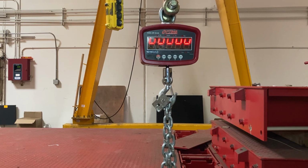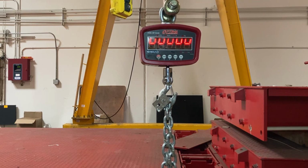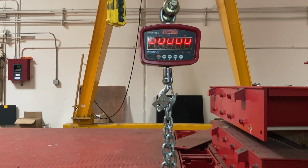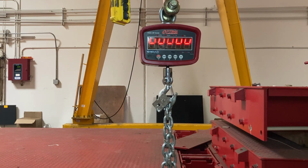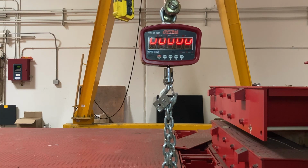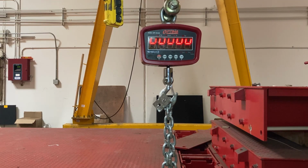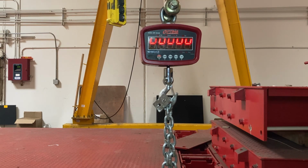In this case, I set the F5 or FS, however you want to call it, to 0.2, which the manual says is 1,000 pound capacity. And well, it's 1,000 pounds, and it's still giving an overload error. I actually had to recalibrate it, and it's still giving me this error at F5 or FS 0.5, which is 2,000 pound max capacity. So I actually have to recalibrate again, and it's only for people that have this error. Not everyone's going to have this error. Maybe you recalibrate the first time and it works perfectly fine.